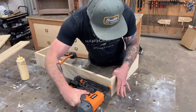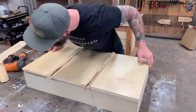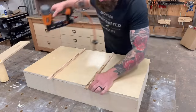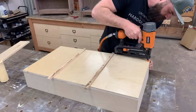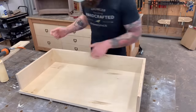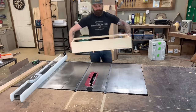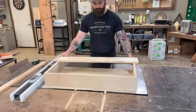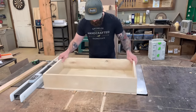We're only hooking together three of the four side pieces of our box — do not hook on the front piece yet; that will be the last thing we do as we're putting the jig together. Also, as you're nailing this together, do not put any nails in the middle of the jig, or the saw blade will hit those nails and you will probably cuss a little bit. With three of our four sides hooked together and attached to the base of our jig, insert it back into the saw and double-check that everything is sliding nice and smooth.